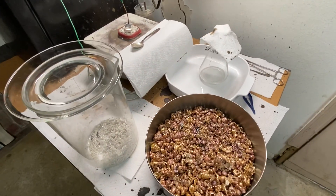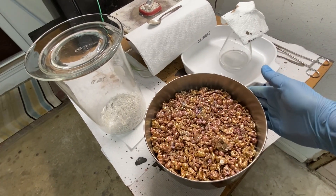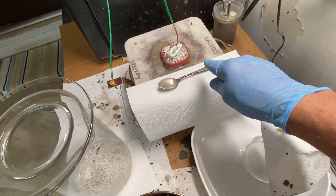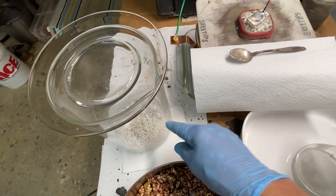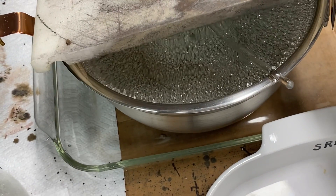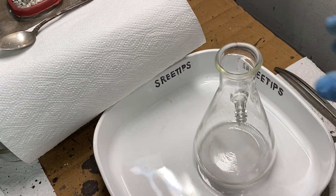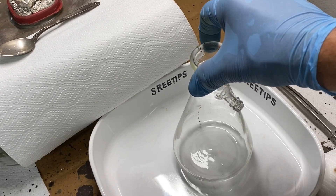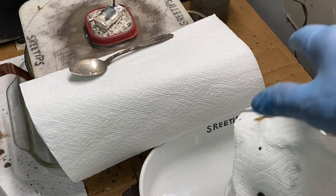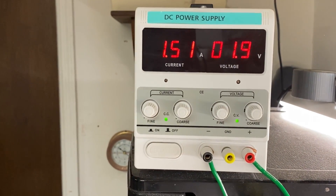This has been the day 4 update. There's about 10 pounds of impure silver in this bowl, and what I'm going to have to do is set up a second cell to start refining this silver. I want to get all of this silver passed through the cell — this is double refined, and when we get done the silver in our cell will be triple refined pure silver crystal. I'll make up some more of this spare electrolyte — I've got a little bit left — and we keep that right here at the cell to replenish the level as already discussed. I'll make some more of that later today. Alright, this will conclude the day 4 update of the electrolytic silver cell. Thank you for watching.